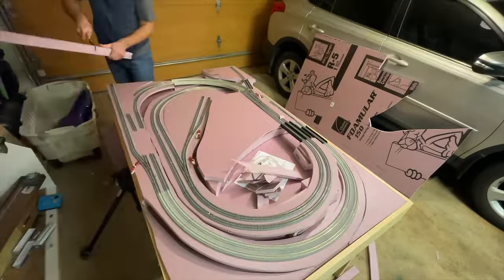The connections on the DS64 are labeled for turnouts 1, 2, 3, and 4, and so getting those connections made was easy with the built-in screw terminals. To control the turnouts by momentary push button, you connect one wire from each push button to one of the switch control terminals, with the S1 terminal controlling the turnout connected to the first set of terminals, the S2 controlling the turnout connected to the second set of terminals, and so on. The other wires from each push button are connected all together and then connected to one common terminal on the DS64 unit. So it was really just a matter of making sure I connected the wires from the DS64 to the correct push button switch wires on the terminal strip.